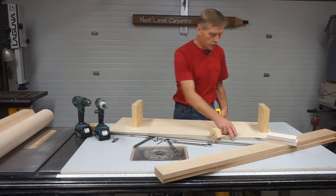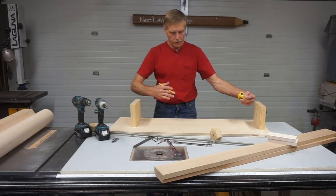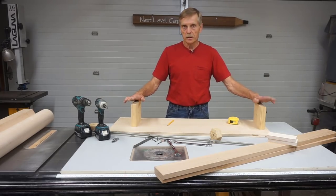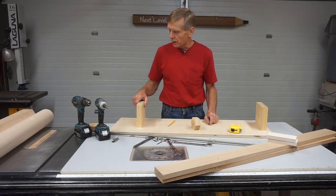And just to be thorough, I'll mention that the center lines of these blocks are all lined up on this piece so that everything is true and parallel. The blocks are the same height, and that keeps all the tolerances consistent. I learned on the first go around that a little bit of lubricant in the hole in this wood wouldn't hurt, so I'll put a dab of grease in there for this setup.